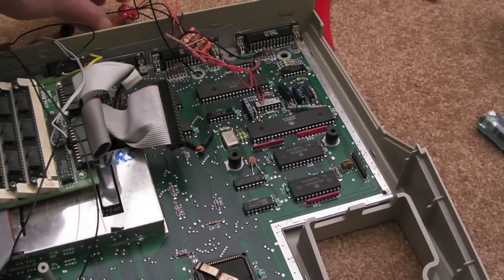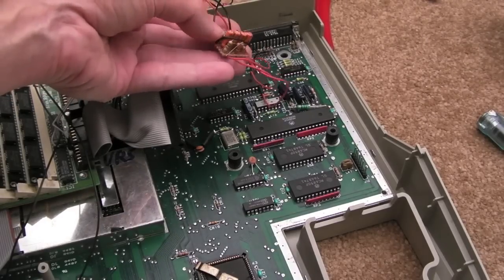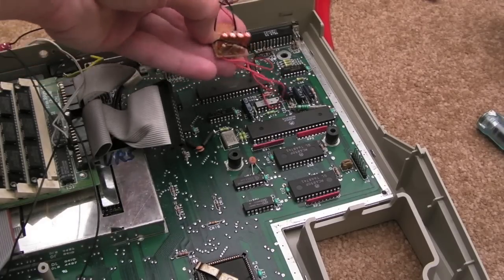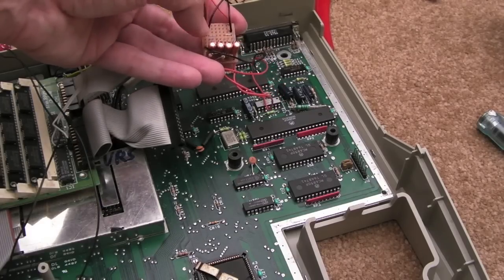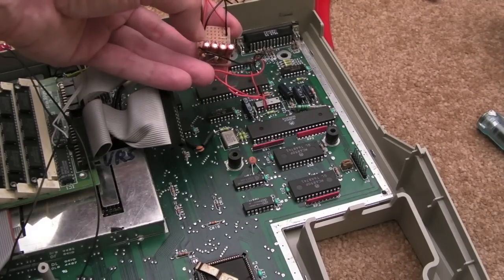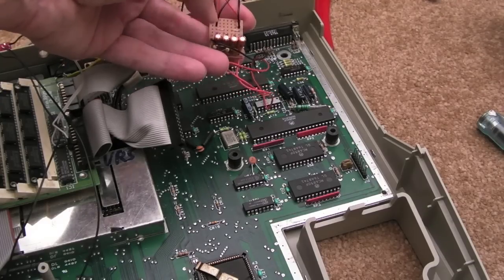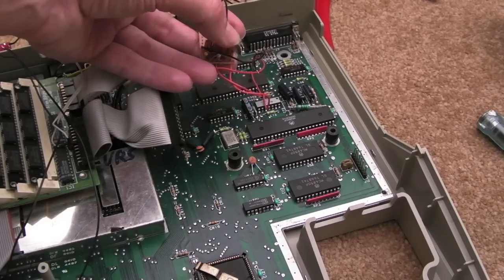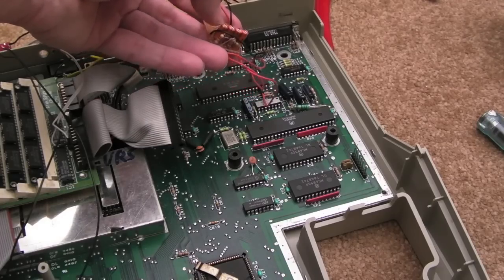But the interesting thing with this, like I say, my approach was, if you check out mmmonkey.co.uk for the Neo Geo audio mod, ever since I did that mod, I quite liked the simplicity of merging, having 3 audio inputs and merging one of them with the other 2. It's like a filter / merging type circuit. That was what the 4 caps and the 4 resistors are, 4 4K7s and 4.7 microfarad caps.